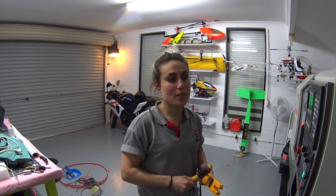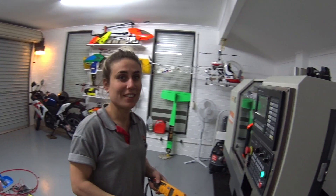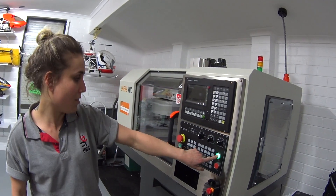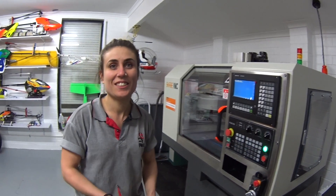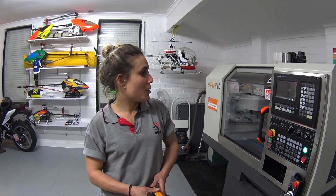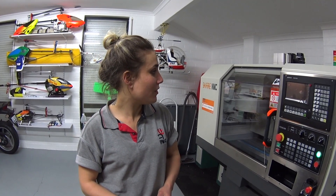Alright, I'll come back hopefully when we power up. We've got 237 volts and a green light on — so it means go. Would you like to do the honours and press the power on? Brilliant. So we've got power to the machine. It sounds like we've got some alarms going — I think it's low air and low machine oil as well.